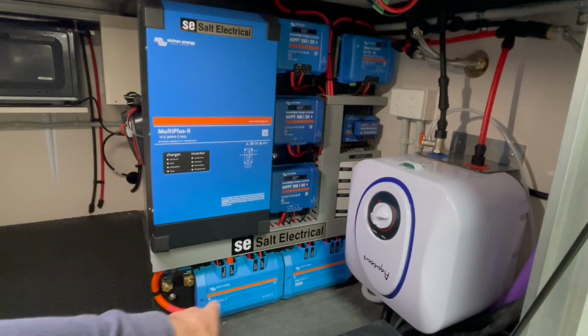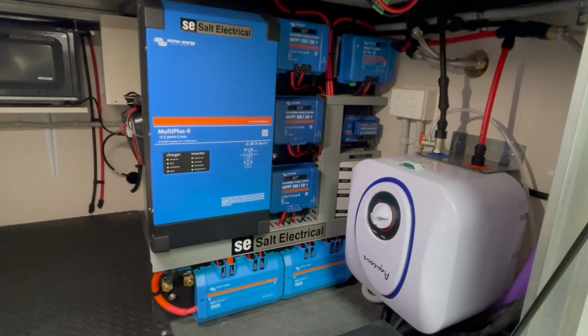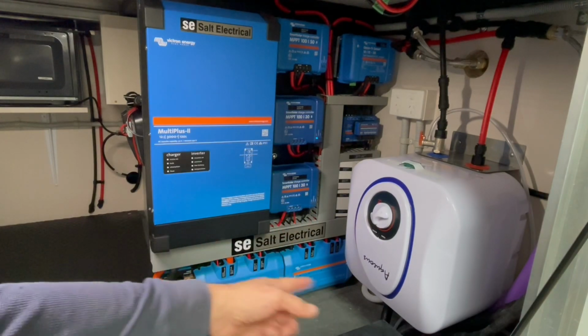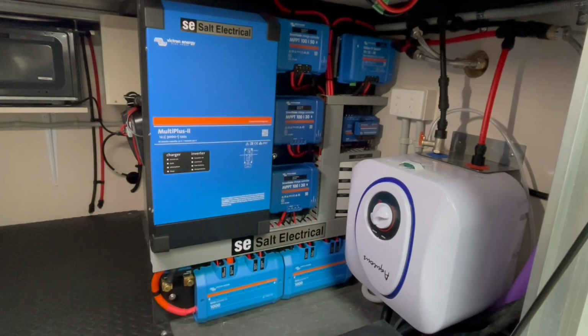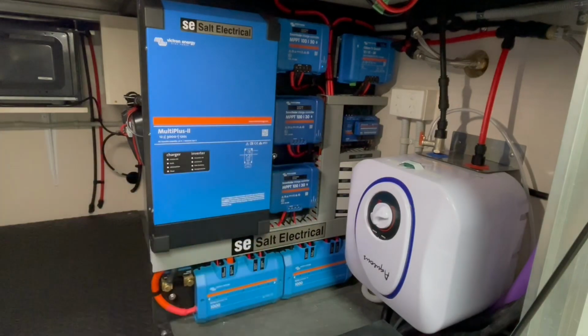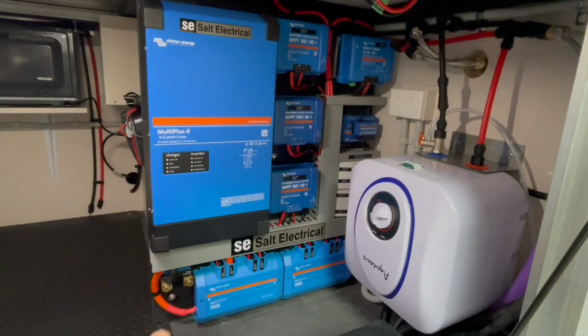This is the Lynx power system. Just simplifies the whole inputs. That's every single line into the panel and to the rest of the van. Then there are mega fuses that sit along that rail there, underneath those blue covers. Just simplifies that whole thing. I've got some breakers over there for shore power in, and also the solar out. That's a really basic rundown of the panel.